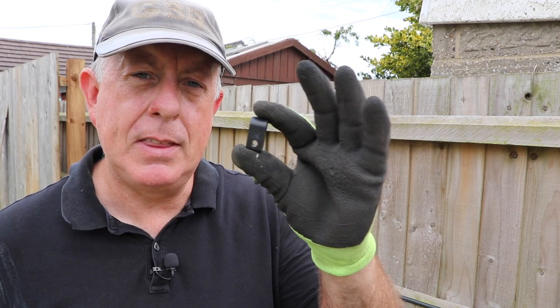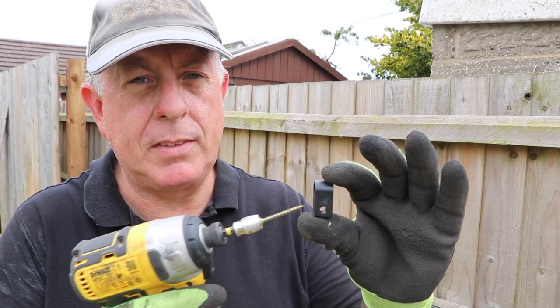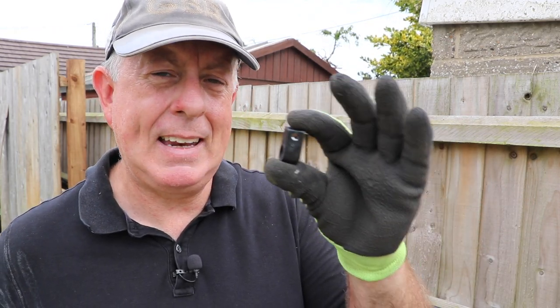Do you put your nails or screws with your cable clips at the top or at the bottom? This is the sort of question that keeps electricians in conversation forever. I prefer to have them at the bottom, because if anything happens to the clip you've still got the support of the nail or screw at the bottom. Having said that, in this instance to get the cable to run straight — sitting in the notch between the cantrail and the post — I'm going to have to put mine at the top and let it hang, which is actually quite tidy and clean. The answer is it's up to you; officially you can use them both ways.